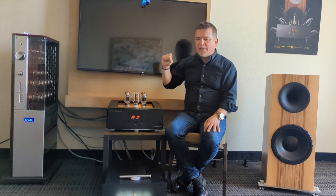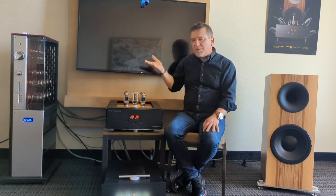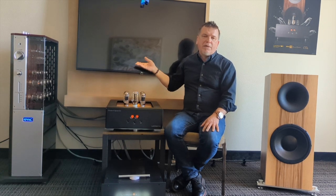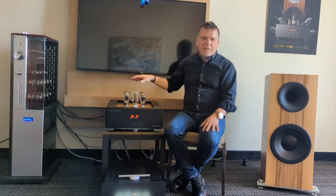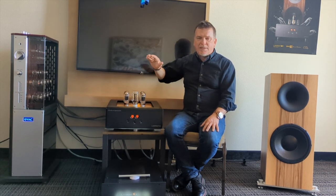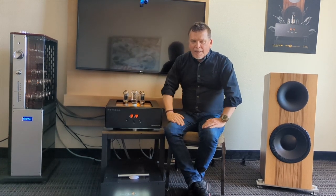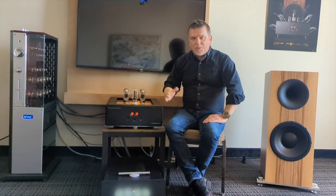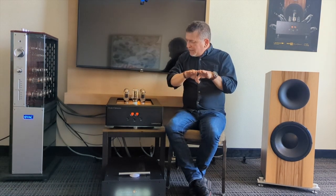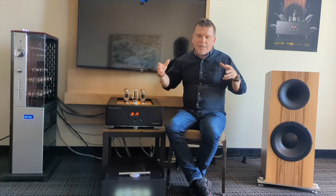It's as weak as a phono cartridge. So we have to elevate it to the generally accepted 2 volt level. And all the other sources are already at 2 volt level, so we don't need to amplify them. So we can skip the tubes and have it straight, pure, clean as it is, as your Studer or your Tandberg or any kind of phono stage produced. Therefore, at the end of the day, on the output level, everything will be equally loud or correctly loud.